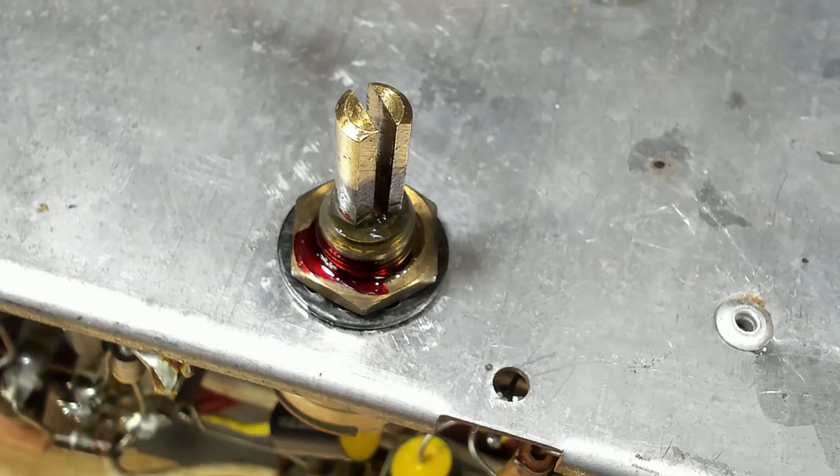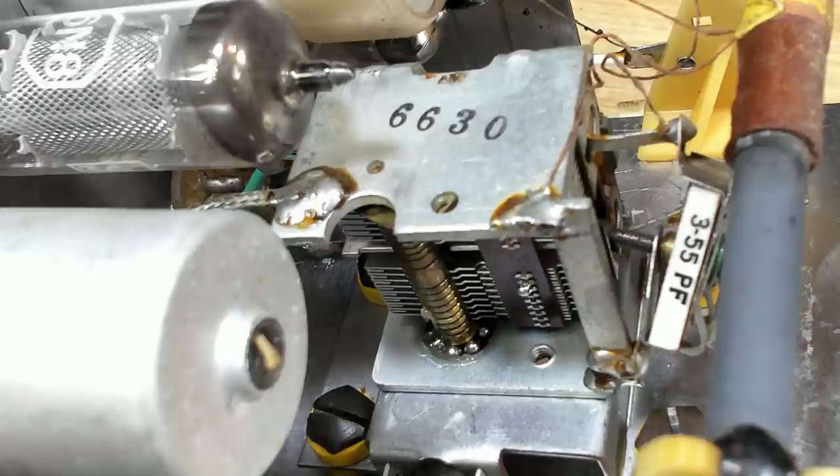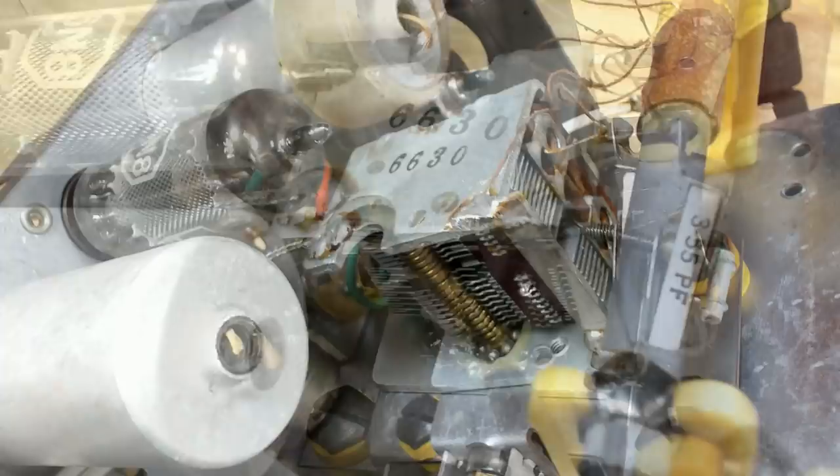A bit of oil is getting in there. I'll let it sit for a bit, put a bit more on it. I took all this out to the shed and cleaned it all up - used a bit of degreaser on the bearings and they cleaned up really nicely. I put the power back on to see if that capacitor still crackles - I brushed it out and sprayed it and blew it out with air. No sign of any crackling now.